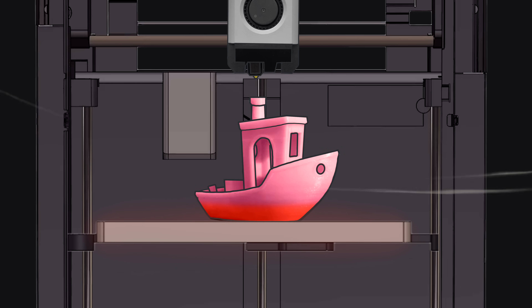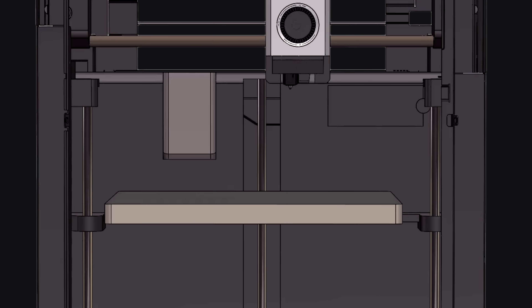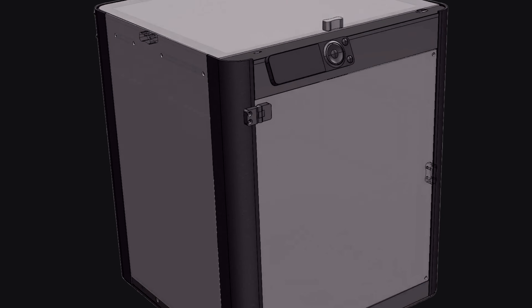The colder air will cool the upper layers of the print. As the top layers cool rapidly, they will shrink — so much so that the gooey bottom layers will be pulled up. This uneven cooling is what causes part warping. So what can we do to stop the air from cooling those layers? One solution is we can heat the air. Luckily, we can use the bed as our heat source, so all we have to do is trap the air into a chamber and it will heat up.